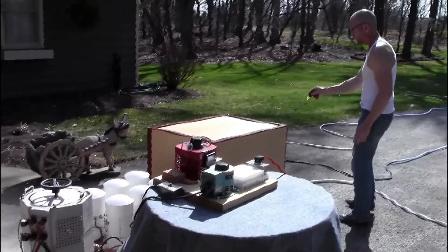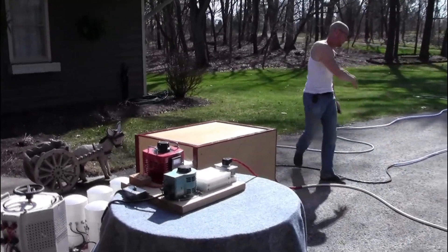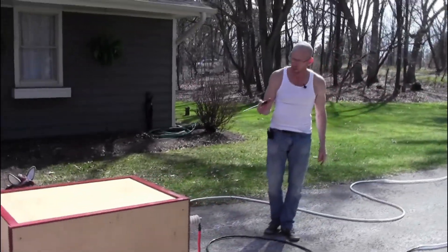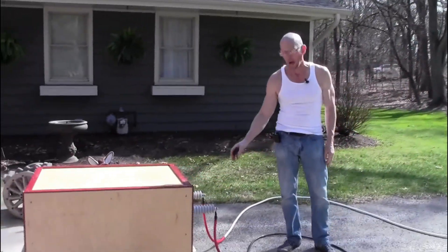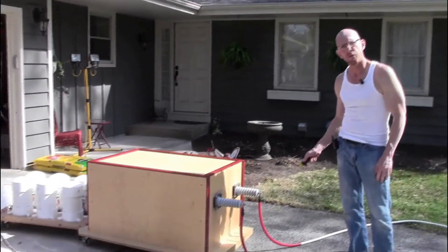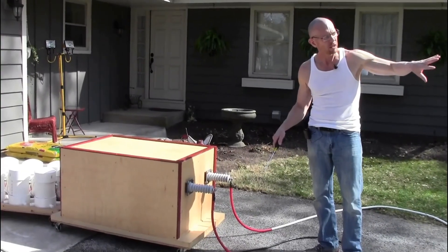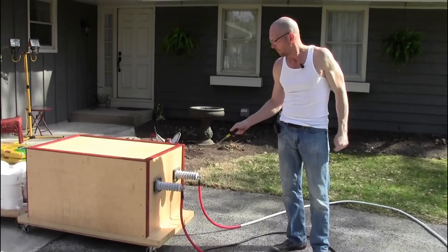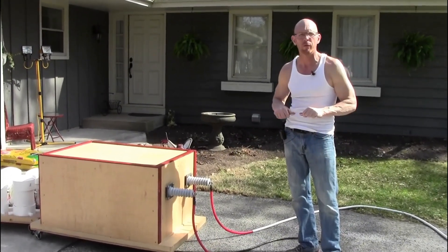From the toy box, we have a set of high-voltage cables electrically bonded to the output of the transformer bank. In its purest form, if no load were connected on the other end, the voltage potential between these two insulators would be 14,400 volts.